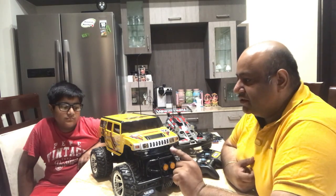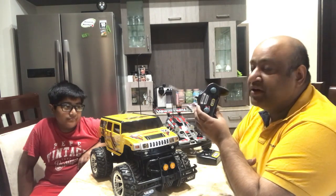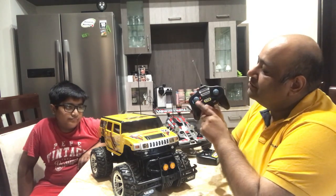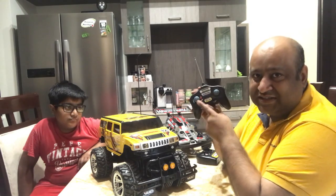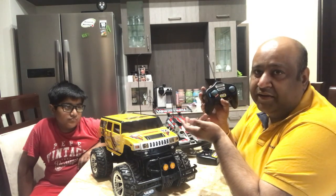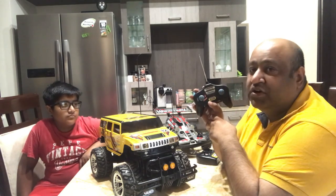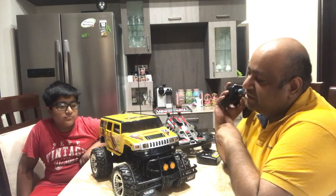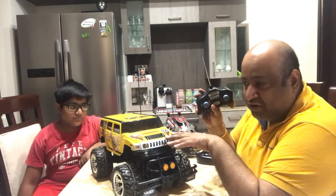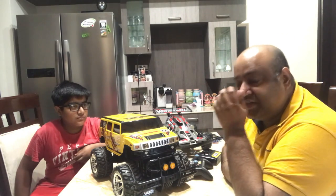The problem with both of these vehicles is that they don't have any speed control on the remotes — when you push the forward button it drives the vehicle at one fixed speed, and the same for reverse. So we will have to do some engineering to tame the speed. Based on our research, it is possible to control the speed of a DC motor using pulse width modulation, and of course it is also possible to control the speed of a brushless DC motor.